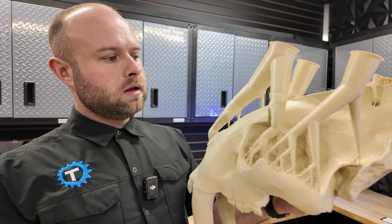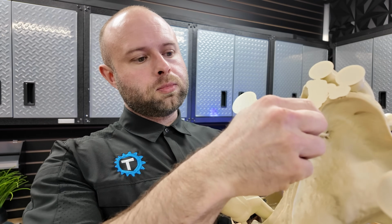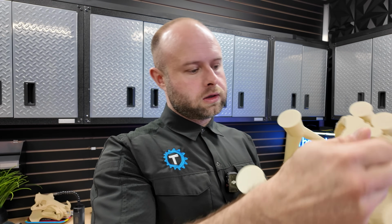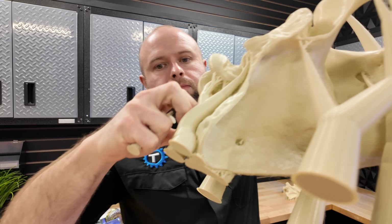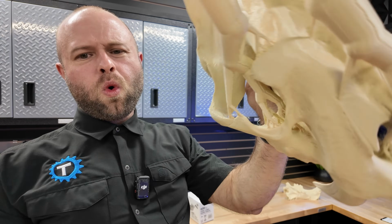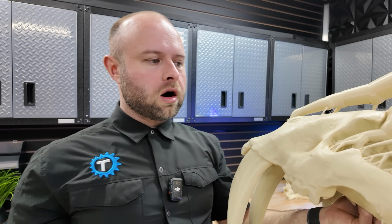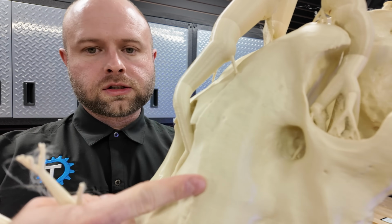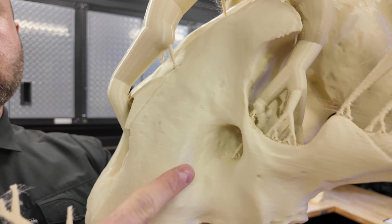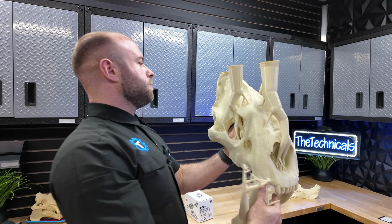0.5 layer height, I think that's our horse. With the 1mm nozzle, the supports are coming off way easier. Not as easy as bamboo matte PLA or something like that, but in terms of, yeah, just way easier. It doesn't leave behind nearly as much scarring or refuse or whatever. And the surface finish, again, it's a thick layer height. Cut me some slack, Jack. The surface finish is much cleaner, much better. So I'm really happy about that.